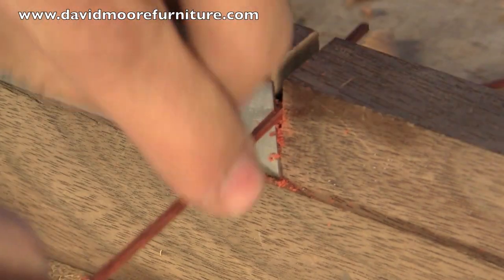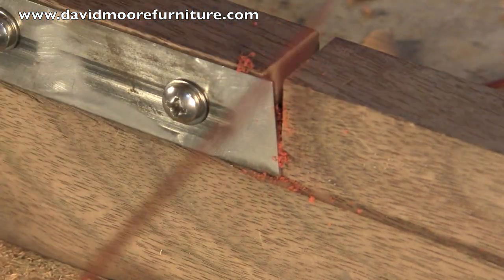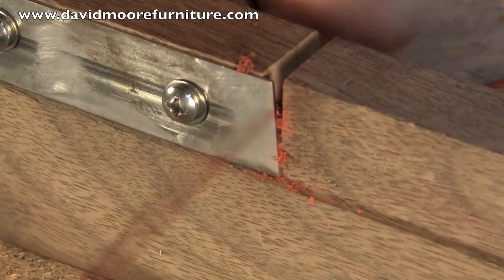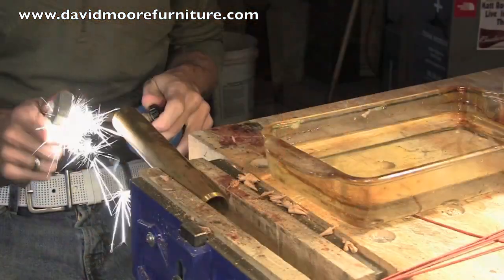This step changes the shape of the stringing by drawing it across the blade. It gives the stringing a slight wedge shape in order to press it in the void made in the last step. Not only does this help in holding the stringing in its void, but the wedge shape will fill the inconsistencies inherent to using hand tools.